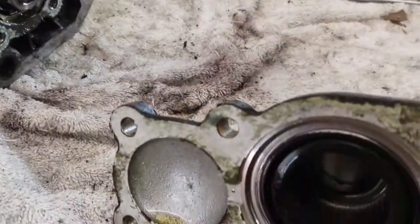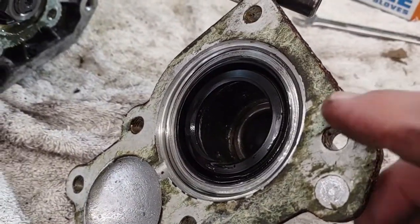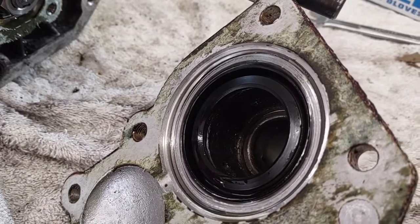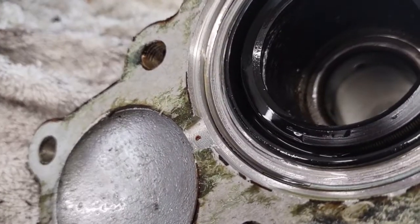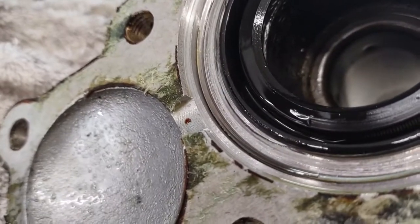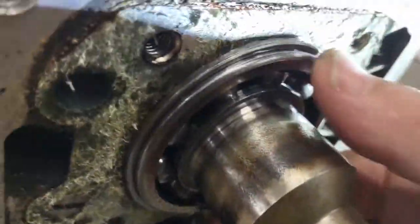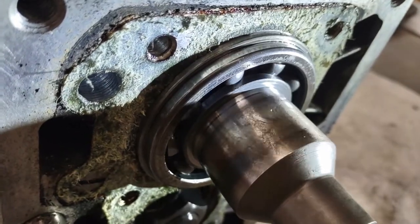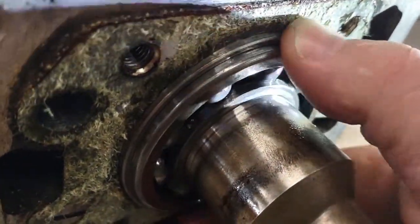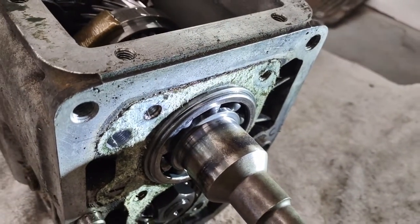In the front cover here there is a spacer ring that is measured for thickness. If you look, you can see the wear on it. I attribute that to the bearing here, which can spin in place. So this bearing is spinning, and because it was able to spin, it was wearing that spacer. That's what I found from that.